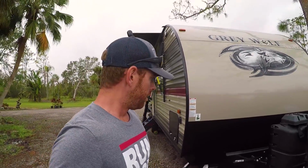So we're taking that off and we're going to have to build and weld on a new bracket to store these four batteries. You don't want to store batteries inside your trailer. Lead acid batteries have the capability of exploding, and the only place I could store them inside is under my bed. So obviously, exploding batteries under my bed is probably not a good thing.